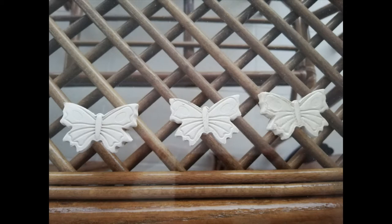As you can see from the figure, these are the unbaked, baked and varnished butterfly shaped models. It can be understood from the figure that the unbaked butterfly has a better surface finish. However, for the baked one, there are some cracks on the surface due to temperature difference. When the varnished one is considered, it has a brighter surface and the protective layer can be seen.